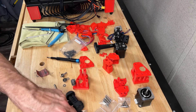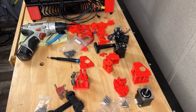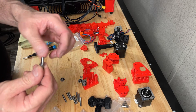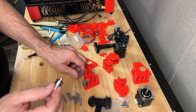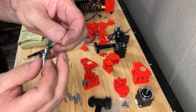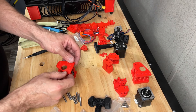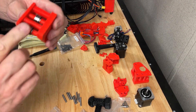I'm not going to bore you while I check all the rest of these pins, but we'll check all the rest of them and then go back to assembling the bearing stacks after I clean up the mess - that does leave a terrible mess on the bench and all over your hands. Okay guys, we're back - got the dowel pins sanded. Back to assembly: shiny side towards the bearing, flange towards the shinier smooth side. Next bearing like that, and you can see this side's got a sharp edge, this side's rounded off - put the rounded-off sides next to the bearing. Set that stack into this pin right here - that's your bearing stacks for the right side. Slide it all together to keep it from coming apart while we're handling it, and that's how it should look.